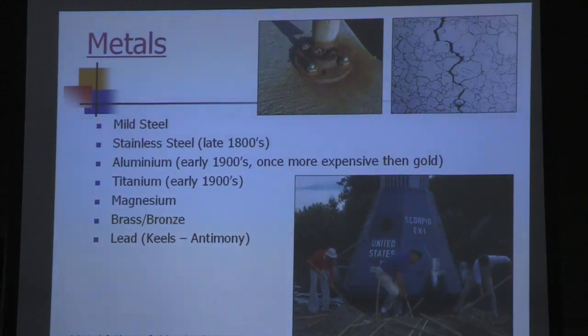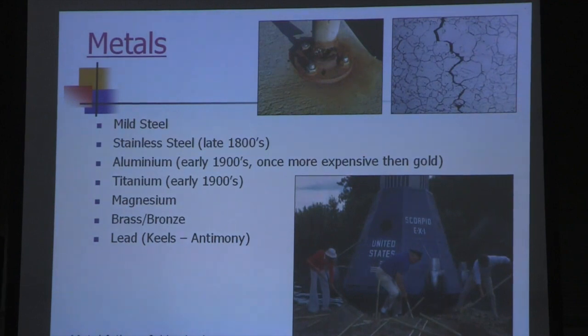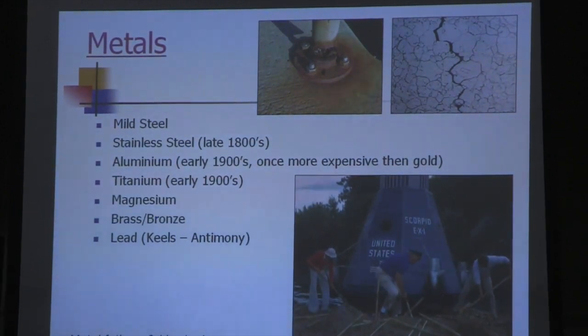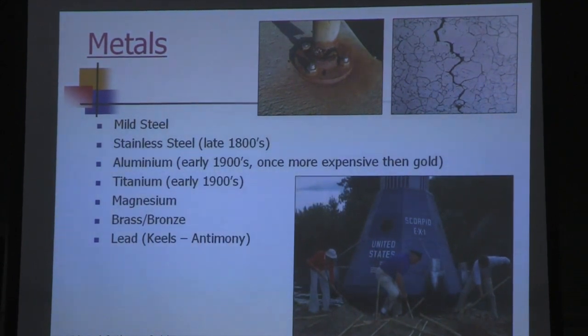And then I'd polish them after that again. No need to. If you want it polished, you mechanically polish it, which will take care of the tea stain. Polish it to the level you want polished, then passivate it, then clean it with the acid. Because once you clean it with the acid, you've got to leave it. If you muck with it, you'll just get back to where you are. Well, passivating means you wash it in acid, then you leave it to air, and it returns the oxide layer.